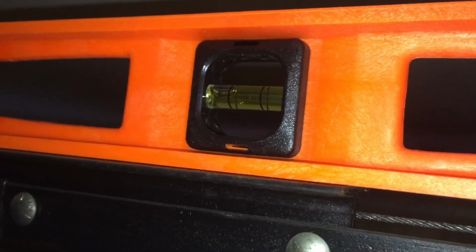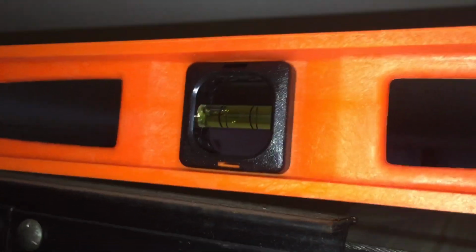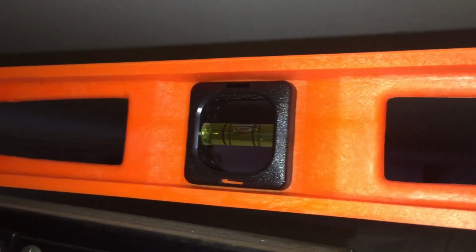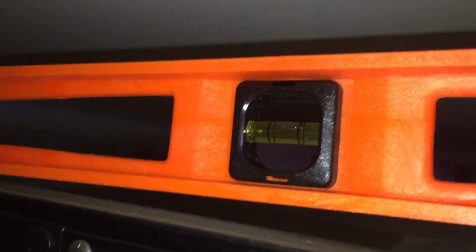So it's always good to have your garage door level, and looks like this is quite a bit out of level at this time. So that will be something that we focus on. Maybe about an inch out of level now. So that could have caused over time the destruction of the gears inside, but with the new installation we'll take care of that.